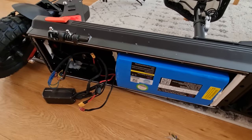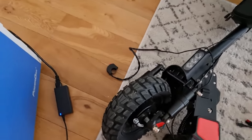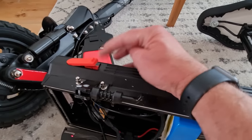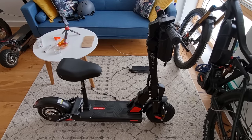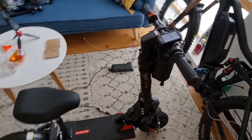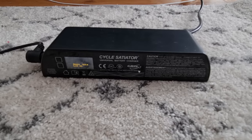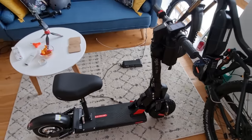Mostly done - I've got the power switch connected, this on/off switch. I've also got a nice little charge port which flips out like an Anderson-style connector and fits nicely in there. Now I'm going to up the power. She's ready - got the power switch on there, throttle's obviously on there, it's all installed nicely back together. Who would even know it's not a standard one? It's on charge at the moment via the Cycle Satiator - at 50.6 volts, chucking five amps in - so it should be ready soon.